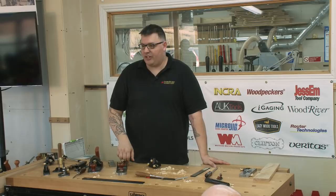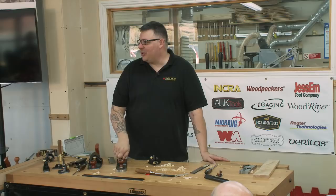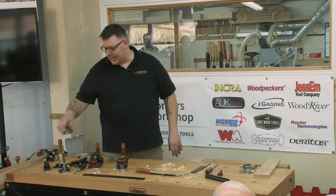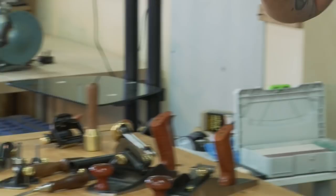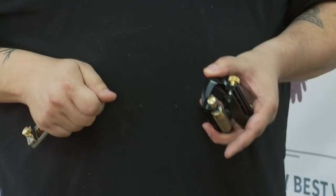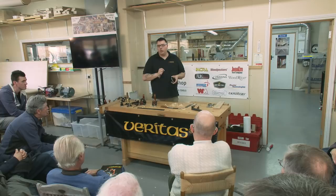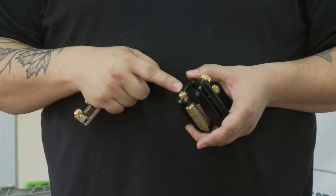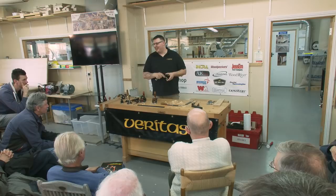I'm more interested in woodworking than metal-working. The long answer is: 40 degrees is good. If you don't have a power grinder, do your primary bevel at, say, 30 degrees, then pull the knob out and put it to the six-o'clock position — because the roller is mounted eccentrically it bumps the angle up by about a degree or two, working out to around 31-point-something. As I always say: who cares what the exact number is — does it do what you need it to do? If so, it's the right angle.